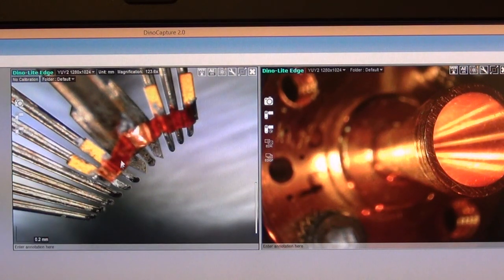This piece that you see here, this red tape that you see here is copper, connecting all the grounds of the capacitors, which are these guys, which are on the DC needles together. So this would be, for example, a voltage supply needle, and it has a decoupling cap right on top of it, and the ground of all the decoupling caps are connected together with a copper film that you see here, and it's also connected to the RF pin.